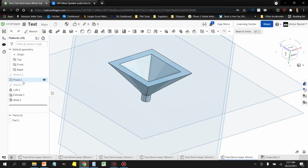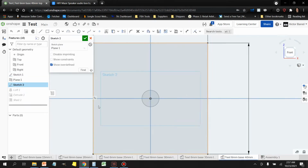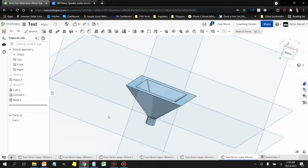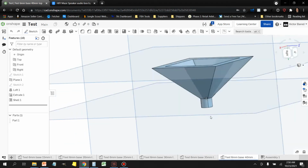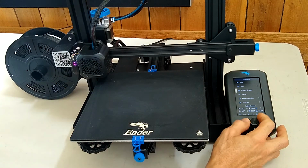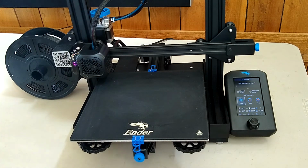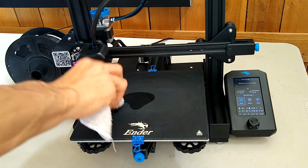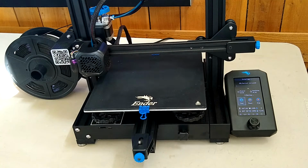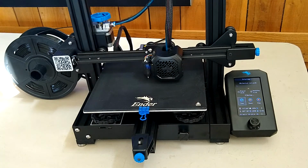They've got a 6mm diameter round base that attaches to the build plate, and they're 20mm in height, and then I've got varying widths. First up is going to be the glass bed tests. So I'm going to run through all the shapes until they fail 3 times, and then that's as far as they can go. I cleaned the whole bed with alcohol prior to printing, and if I ran into any problems with the prints, I would re-clean the bed.